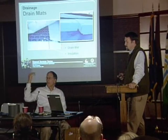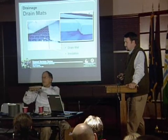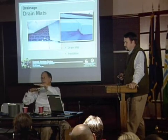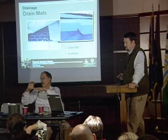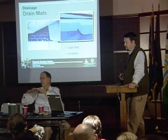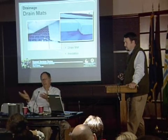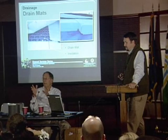Actually, what's interesting about this building is that the insulation on the original membrane was laid on top of the deck, and then it had the waterproof membrane, which was an EPDM, over the top of the insulation, and it was 1.5 inches, because of whatever the code was back then. And then on top of the EPDM membrane was all the gravel, which gave us the structural capacity to hold the eco-roof. That is kind of a standard for EPDM that was used quite a bit, because the gravel holds down the insulation and the whole system, and you don't have to have fasteners and all kinds of other things. It seems to me like it was a pretty good system, and a lot of people have gone away from that approach. But anyway, that's what we had.